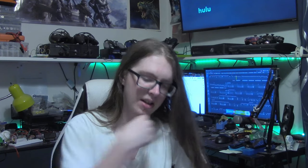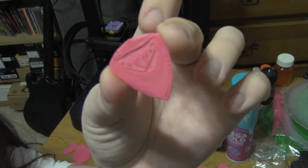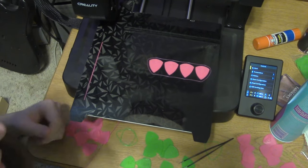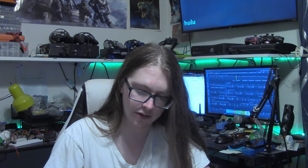Before continuing, I need to mention that I started testing with my Polymaker Polymax PLA Plus filament, because that was the filament I wanted the final product made out of. The first print I forgot to clean the plate and used no adhesives — it was a mess. The second print I cleaned the plate and used no adhesives — it turned out the same. Next I tried with hairspray. We got a batch print to complete, but the results were simply abysmal. The farther from the middle of the bed, the worse the prints turned out.